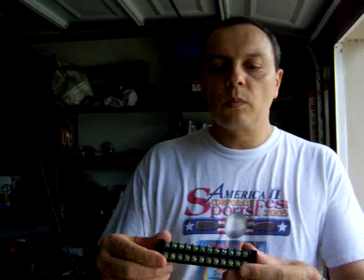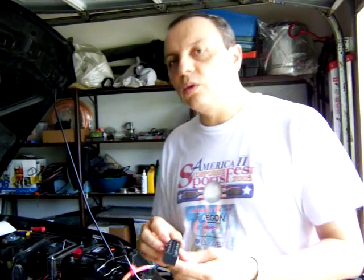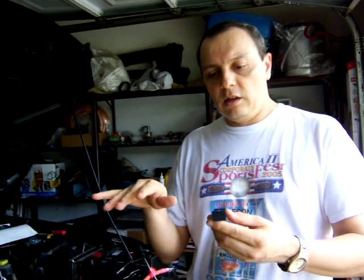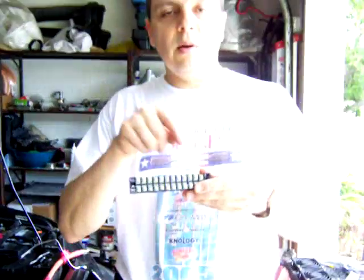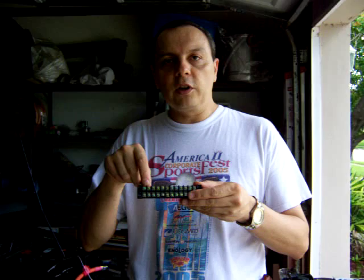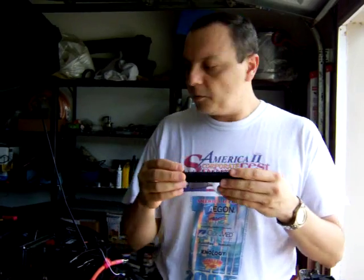One more thing I'm doing: I bought all these connectors — multi-connector tabs — and I'm going to use these for the batteries. Since you need to monitor the batteries and make sure they're balanced, I'm running cables from each battery so I should be able to bring a pair of cables to each one of these terminals, and from here measure the voltage on each battery and balance them as needed. This is going to be very useful.